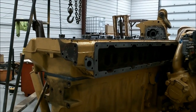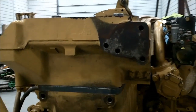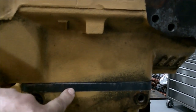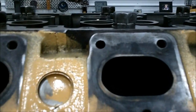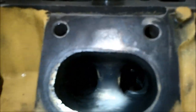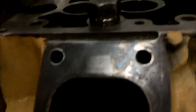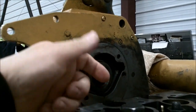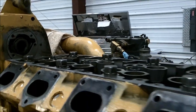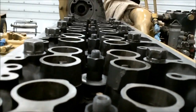I've been gone for a week down to beautiful San Antonio, Texas, so Jake put the head on while I was gone — he's got it all on. We've got a new spacer plate between the head and the block. These are the exhaust ports, and you can see the new seats down in there — this is number six. You can kind of see how the cam drive works: a drive shaft comes through here and goes into the exhaust cam. He's got the pre-cups installed, the fuel nozzles, and the glow plugs. And here's the intake side.